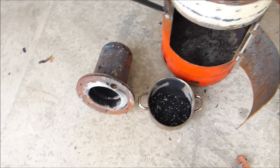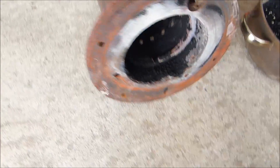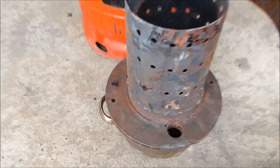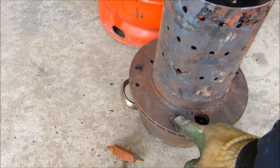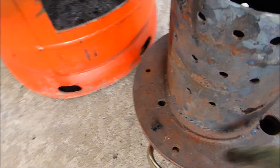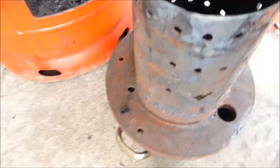The components for this whole setup, with the exclusion of the flue — that's it on the floor. Stainless steel pot, and that's it. This bolts it down and pulls the handles up to the brake disc — makes a nice tight seal. The oil goes in through this 30mm hole. I do have two air holes at the back, about 10–12mm, for letting air in.